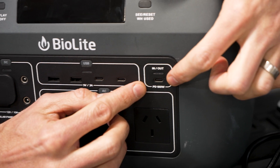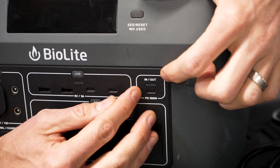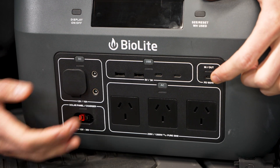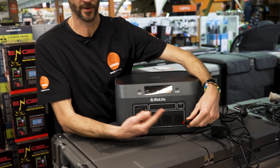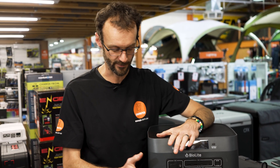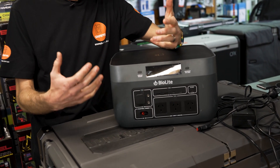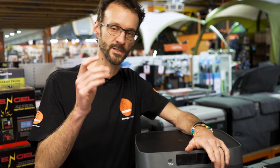On the opposite corner, there's a USB-C PD port — USB power delivery — which charges at anywhere from 5 to 20 volts and up to 5 amps. We can plug both the wall charger and USB-C PD in at the same time, reducing charge time down to about 8 hours. On top of that, you can use solar to charge this as well. You plug the solar into this port — you'll need BioLite solar panels with the same connector — and you can chain up to four of their 100-watt panels together. That's 400 watts of solar at 20 amps max, taking about 4 hours to fully charge. There's a built-in MPPT — maximum power point tracking — controller, so you don't need a separate solar controller; just plug the solar straight into this unit.